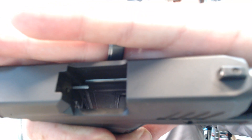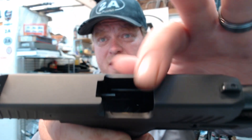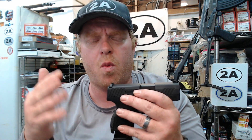This little prong that sticks out — that's your ejector. After it extracts the round out of the chamber, it hits this little fine piece of metal. It's strong, but if you were to whack it hard with the baseplate of the magazine, you could bend it and cause your pistol to malfunction. That's why I'm just gently inserting it — we can see it just does not catch, it does not click, but it does actually fit.